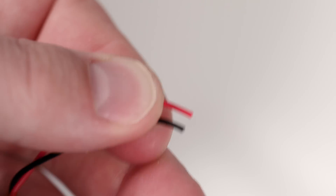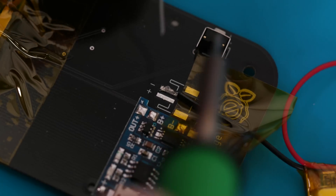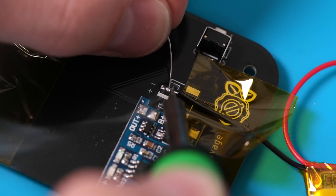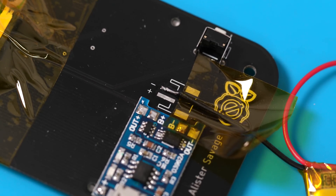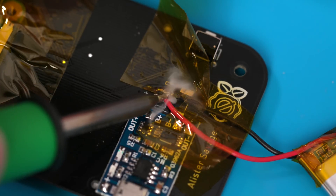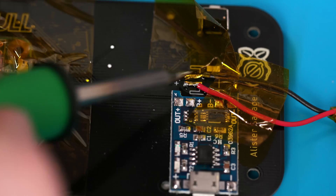There's really only one step left, and that's the battery. Cut the connector off, because we're actually going to be soldering it directly to the board. Solder the black wire to the minus connector, and then solder the red to the plus connector. Obviously don't let the two wires touch — just don't let them touch. I found that taping the cable in place when soldering made things way easier. Flux is also your friend in this situation. Once it's soldered, cover it up with Kapton tape and we're done — the soldering at least.